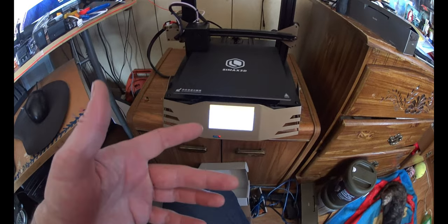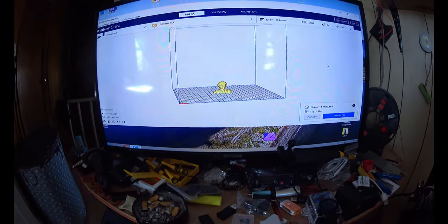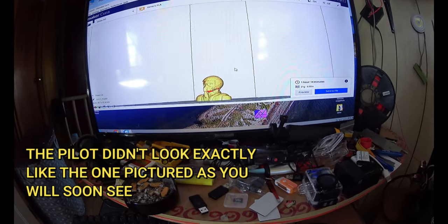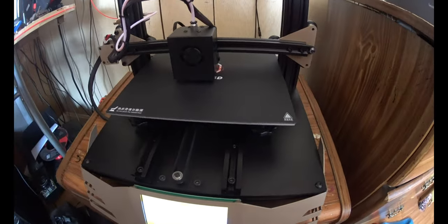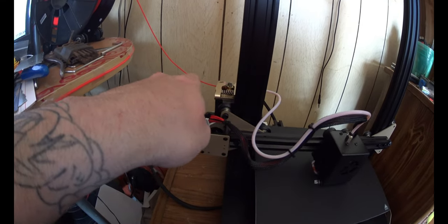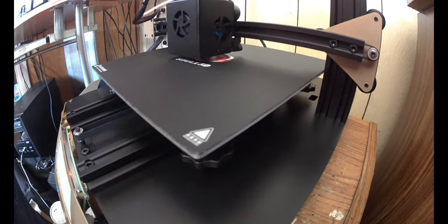Okay guys, as you can see here I have it all hooked up. I just set up a little pilot for my RC planes — I'm going to try and print a pilot. You guys can see what he looks like. It's pretty detailed. It's now printing! It wasn't too hard to set up. I just had to readjust the extruder where the filament feeds in — this little piece was pushed down too far and it wasn't grabbing the filament and pushing it through the feeder. But you can see it's printing now.